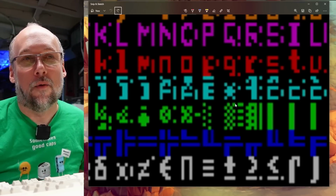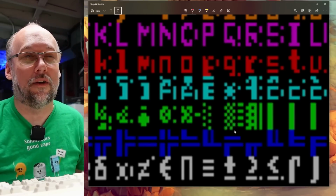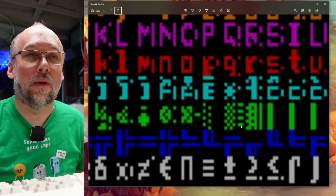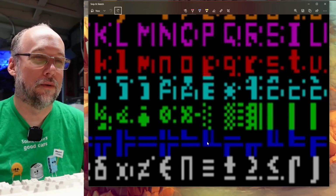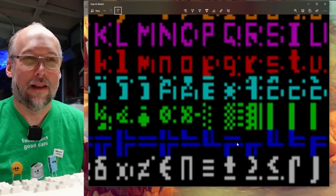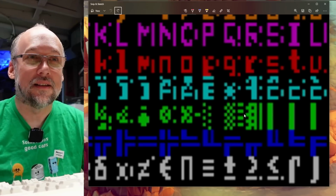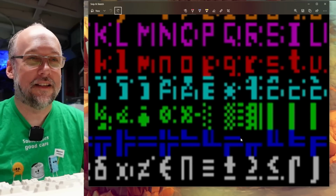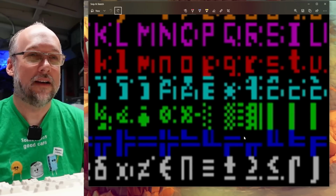And you can see one of the issues is we have an entire column of pixels that are missing altogether. But then we have two that are repeating here. But the funny thing is, take a look at this symbol, or this one here. It does not have the missing column like the one above it. That's sort of strange. And then the next thing that's funny is this column here, it doesn't seem right either, because it should have two pixels, one there and one there, and it's missing one.